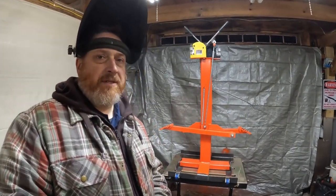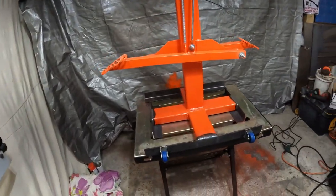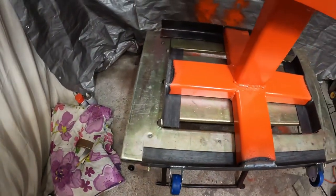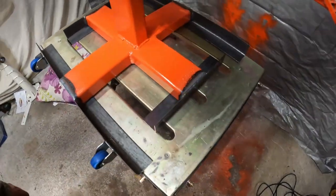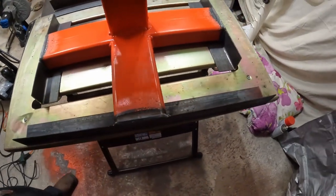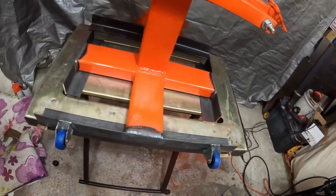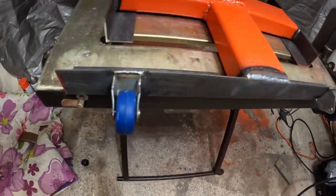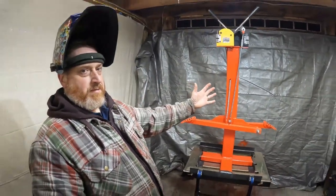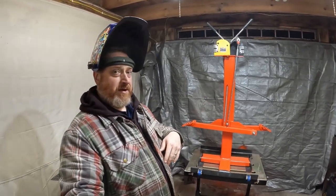All right, guys. Just a little interruption before I finish the video. I understood that the rocking was an issue and my floor is pretty terrible. So here's what I did to solve that. A couple pieces of angle iron all the way around, kind of disperse the forces on the ground and spread it out, because the floor is so uneven. And also, I threw these little casters on here, that way I can tip it forward, and I can roll it around. So back to the video.